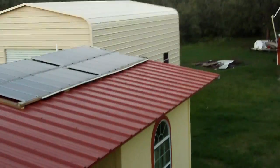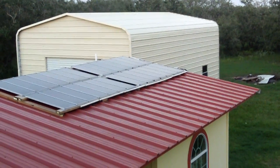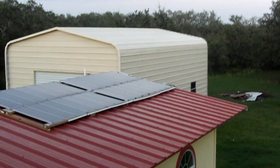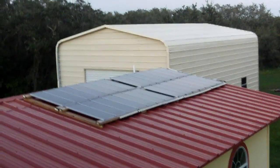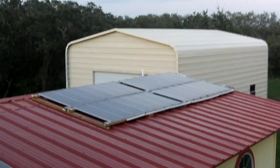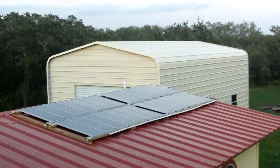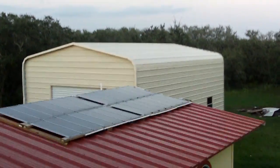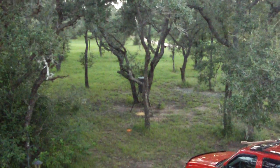The wire that comes with these panels is 12-gauge and the panels put out 100 volts, which is really good news — I get less than 5% voltage drop from the furthest point all the way out to where my batteries are in the shed. Then I'm going to use two Outback 80-amp charge controllers to drop that voltage down to 24 volts — both for the turbines and because pretty much every grid-tie inverter worth its salt is made for 24 volts. The Outback controllers are electronically settable so they automatically adjust.